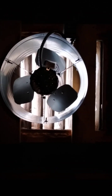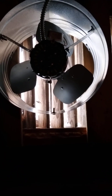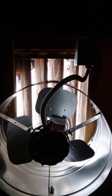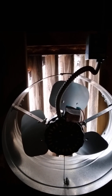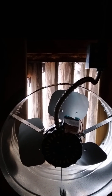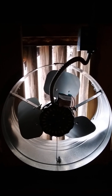The only issue I may have is the fan is a little bit smaller than the gable opening. So if it doesn't adequately cool this attic, what I will do is upgrade to a larger size, or put another fan in the other gable. I'll recompute the square footage that needs to be displaced. It's hard to tell because the roof here is fairly large and a lot of heat is coming through.